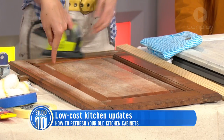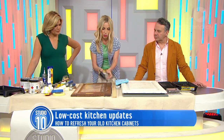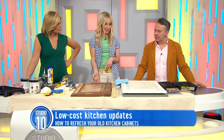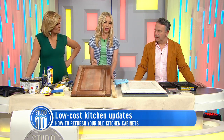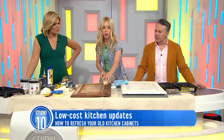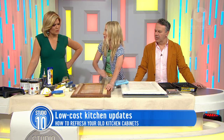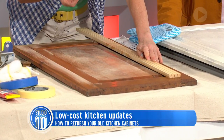For the little parts and joints, you do that by hand — grab the sandpaper and get inside those fiddly bits. A lot of people have these old bevel doors and even if you paint them, they still look old. A little trick I've learned over the years is to go to stores like Bunnings, get yourself a piece of timber trim, cut it to size, and camouflage the old bevel to make what's called a shaker style cabinet, which is very popular these days.